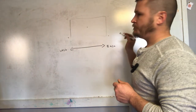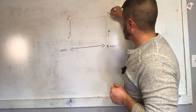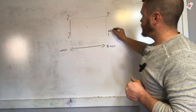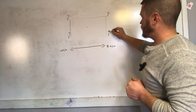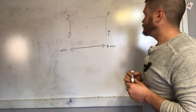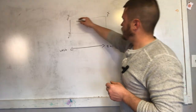Once I get all of these corners marked, that'll give me kind of where they are. Let's say I want my sidewall to be three foot tall and my laser mark is, say, seven inches off the ground. All I need to do is figure out the difference and add enough to make it three feet, then add that to all four of those corners. Then I'll take a screw and put it in at that level on each corner and run the baler's twine off of that.